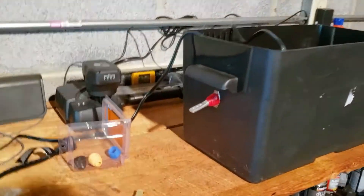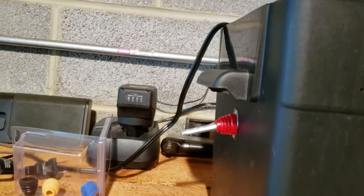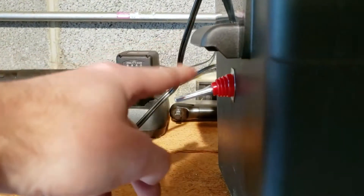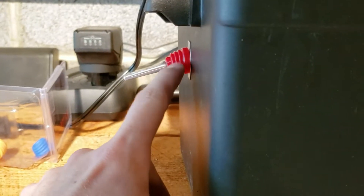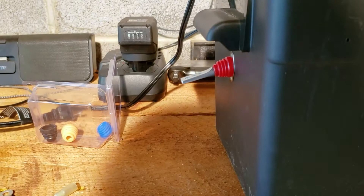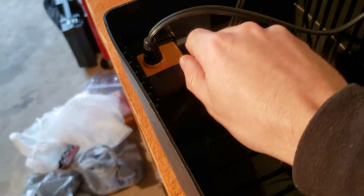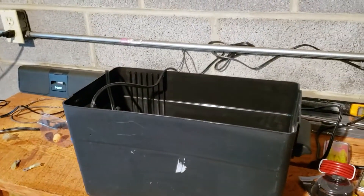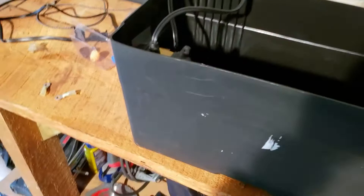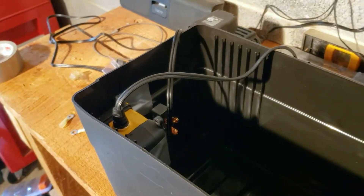We drilled a half-inch hole and put in our switch right there. I put it underneath the handle so there's a drip edge so water will run off and not really get to the switch, but if it does get wet there's a weatherproof little boot there that keeps it kind of dry. We've got our charger just duct-taped in this corner here, and I'll show you why I put it there in a minute. So now let's get the battery in, hook the charger to the battery, and pull the switch back out so we can wire the switch to the battery.